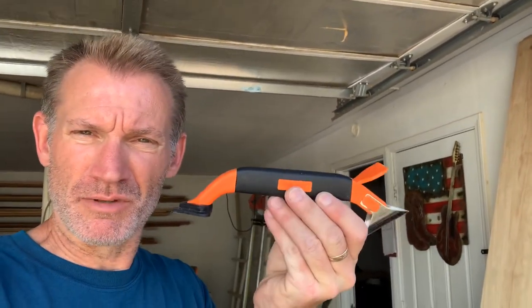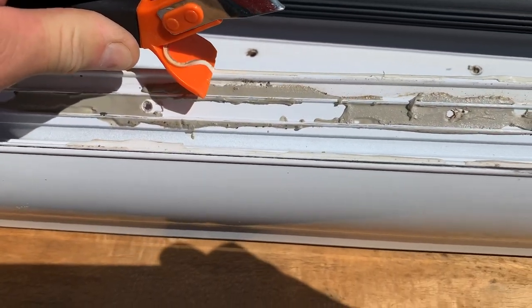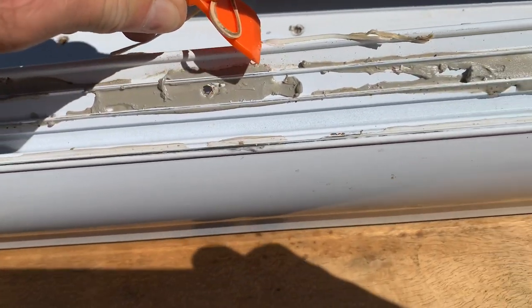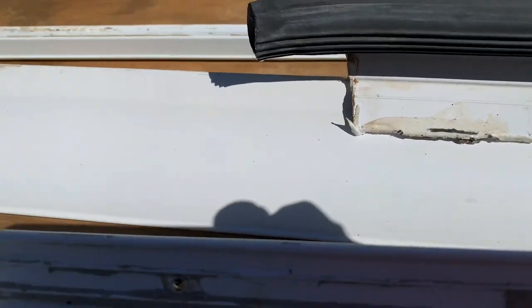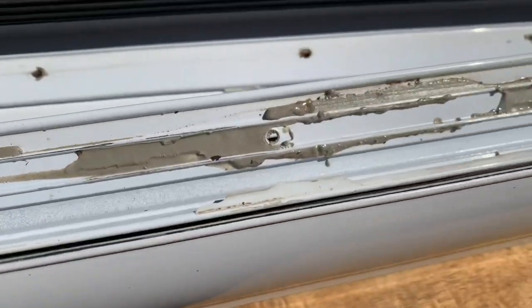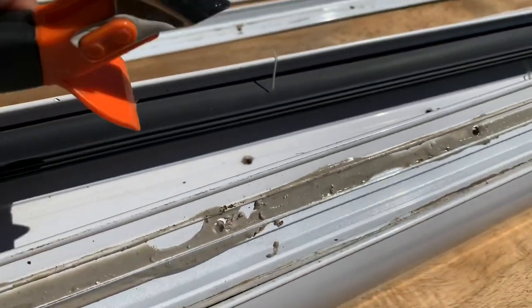The razor blade works really well for fiberglass surfaces. If you're trying to get sealant off a painted surface like some of this aluminum trim, I suggest using one of these caulking tools — it's got a plastic scraper on the backside — or you can use a Teflon scraper or Teflon putty knife, so you don't risk scratching your paint. You can get under the caulking with this plastic scraper and it comes right up. You can also use the plastic scraper to get some of this butyl tape off — I scraped most of it with a screwdriver but when it's up against the paint I'll use one of these plastic tools.